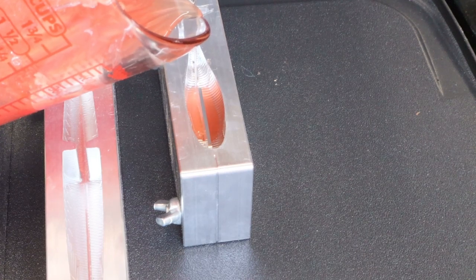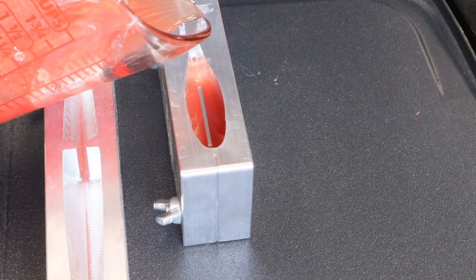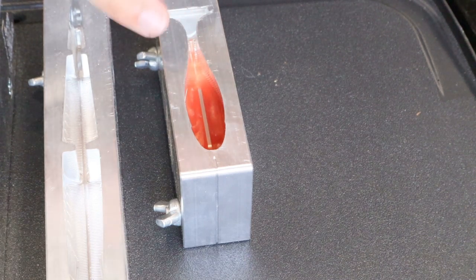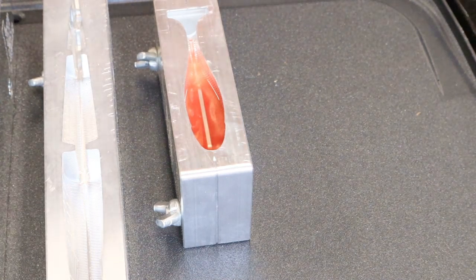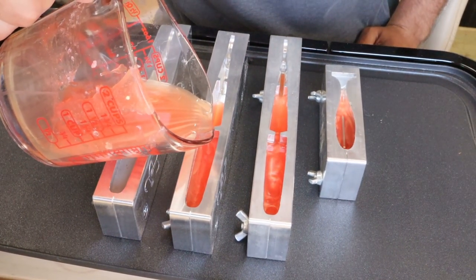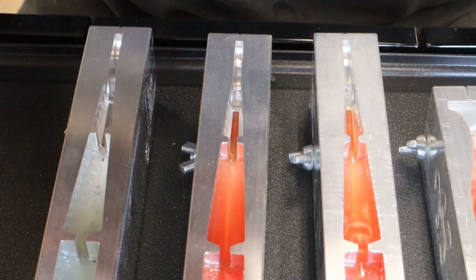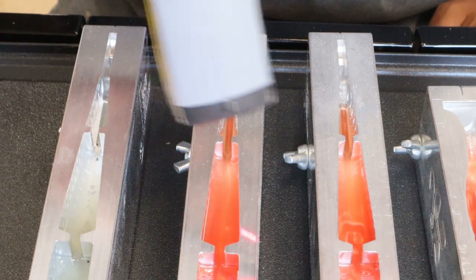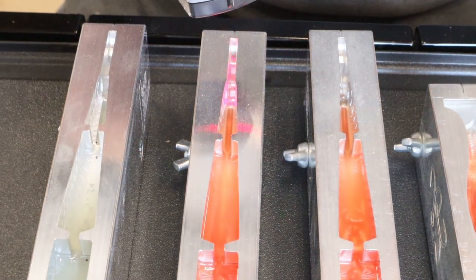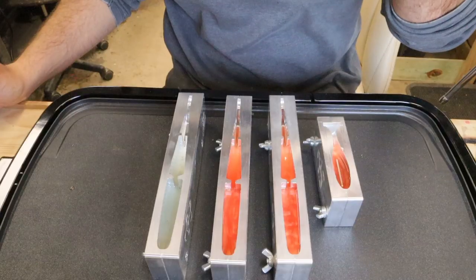I just screwed up — I think I hit the side. I'm going to put just enough to fill up the tail and come right over the hook slot — fill up that fin on the bottom and let the plastic skim over the hook slot. I have too much fun with open pours and forget about the camera. That fin filled itself up — I didn't pour that, it just filled itself up. Very nice. The plastic is at 270-280, the griddle under the molds is 400, and the tops of the molds are reading 250-300. It's still gooey. I think I might turn this thing down a little bit — we're experimenting.